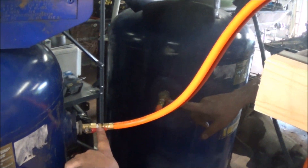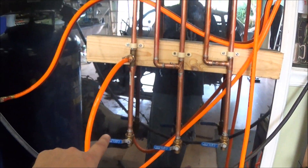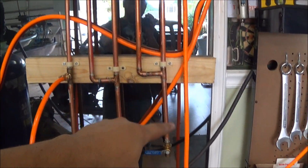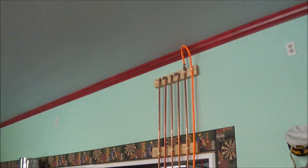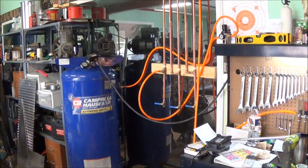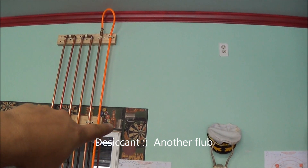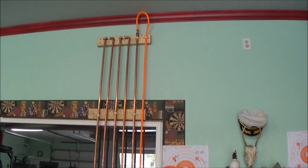It's up on the wall now. Basically we've got the line coming out of the compressor — I am going to switch this ball valve out to at least a half-inch — comes over here, goes into the regulator, max 90 pounds, comes out of the regulator and goes into my dryer. The dryer has the first vent going up and down to the second vent, up and down to the third vent, up to my hose, out to my tools. I did a paper test and it seems to be working — I don't get any moisture when just shooting the air gun on the paper. Soon I'll be adding a desiccant dryer up there before the tools — that'll be in the next video.